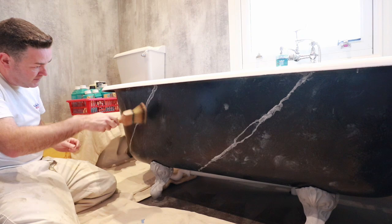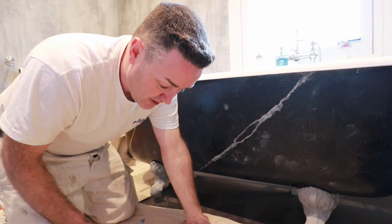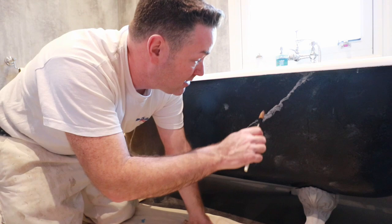Brilliant, I love it. Right, I'm going to stop the video. I'm going to do a few more like that, and then I'll come back to you so I'm not boring you too much. But the principle is, I've got a nice soft signwriting sable artist brush. I'm putting some scumble on with a bit of white hemmy, and my hemmy is giving me some nice veins. So I'm going to do a few more of those, then I'll come back to you. So see you in a few minutes.